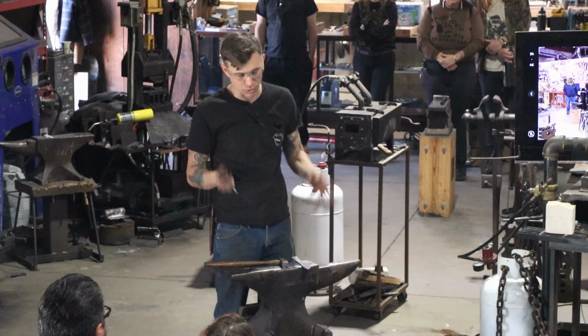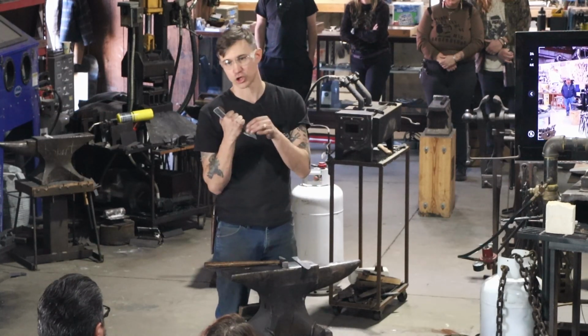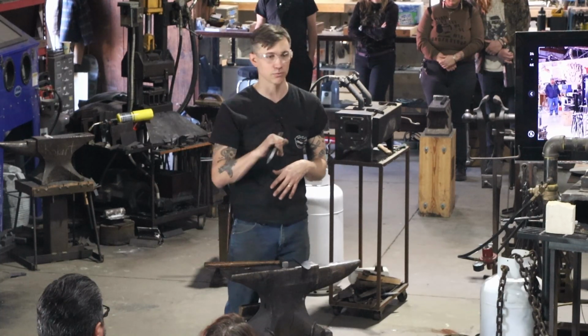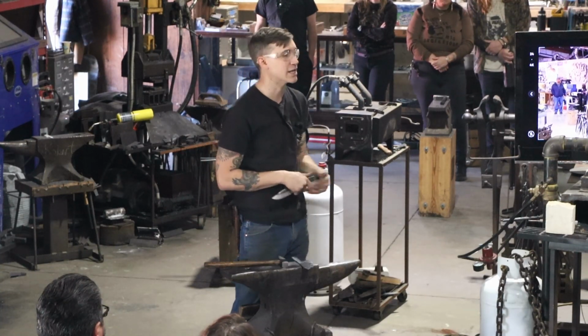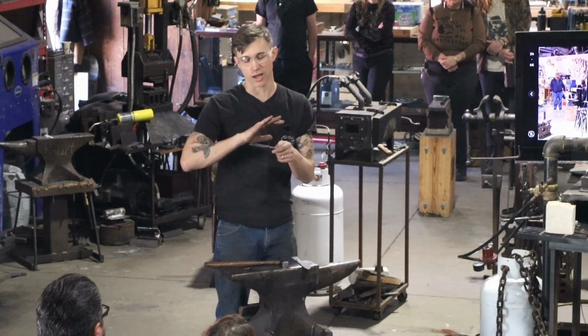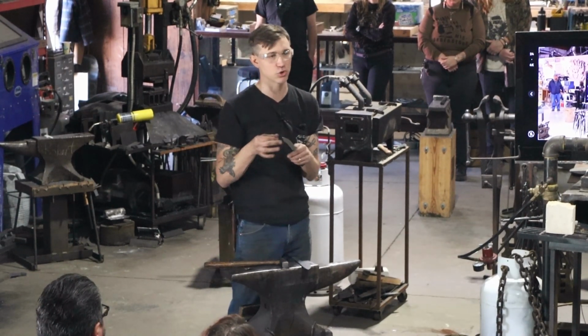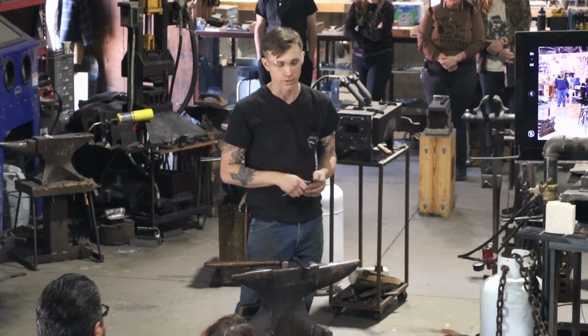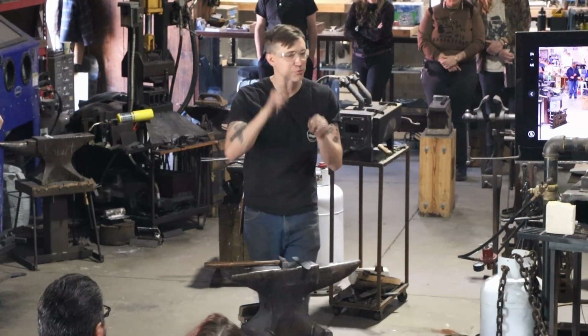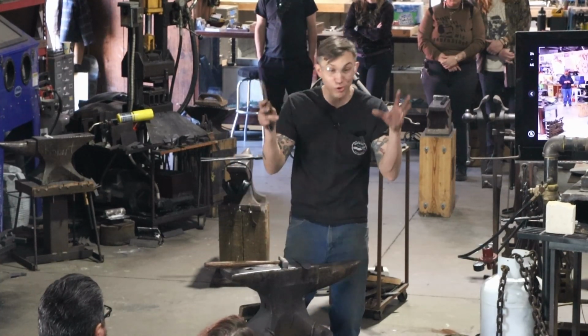So I have determined for myself that the overall geometry is more important than the edge sharpness on a knife when it comes to its performance. And again, the edge sharpness is something that's pretty easy to tweak later, take to a guy, but how you make that knife overall, geometry-wise, is a lot harder to fix later. So they just keep getting thinner for me, to be honest with you, because they just pass right through that paper, and people go, ooh, you know.